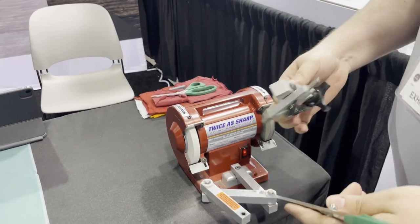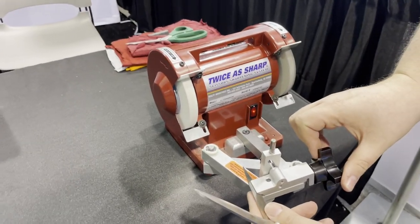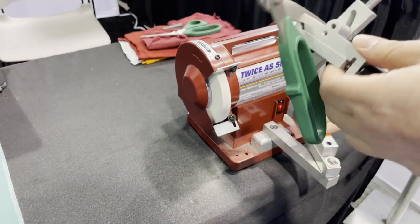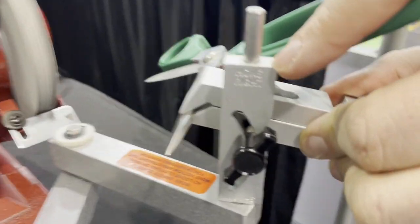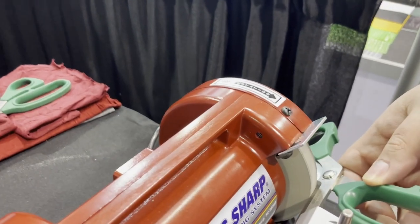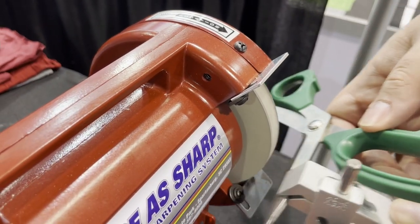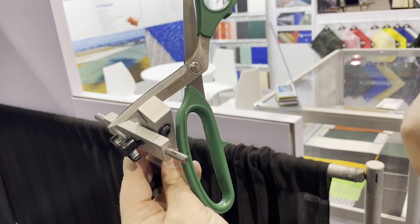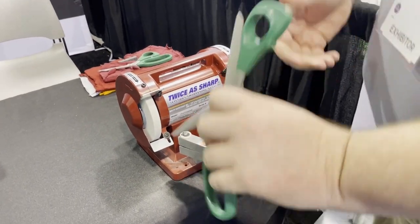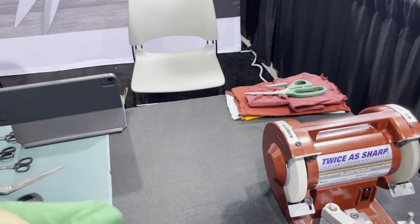I'm going to hone one of these blades. Still with the sharpened side up, I mount the scissor, put it inside here, nice and tight, make sure it's even. Now I'm lifting this back out, moving the arm over here, and flipping the clamp over — now you see right there it says 'hone,' I'm on the honing setup. I take it to my compressed cotton wheel and add that polish to it. Adding this polish makes things like slide cutting — whether you're cutting fabric or protein — so much easier to use.